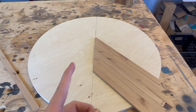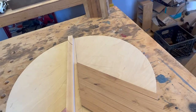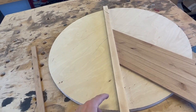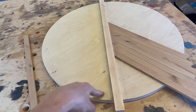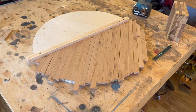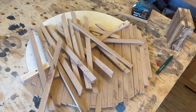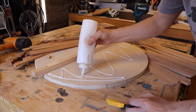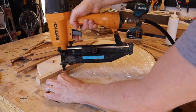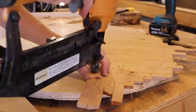I'm just going to ride that line, but here's a tip: if you have a solid straight piece of wood, you can run it across as your hard line and straighten those out, run those up right along it. I'm actually going to secure this down to this board because after I'm done, you're not going to be able to see it — so I can just screw straight into this piece of wood and run these all up along it. When you've got this side all nice and laid out, just duplicate it for the other side. There's really nothing to it — just glue and nail these strips to the circle. Make sure you have good glue coverage and make sure your nails are not too long, because it will shoot through and nail your board to your workbench.